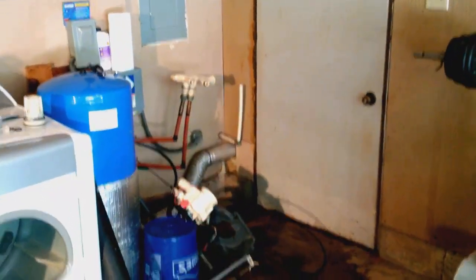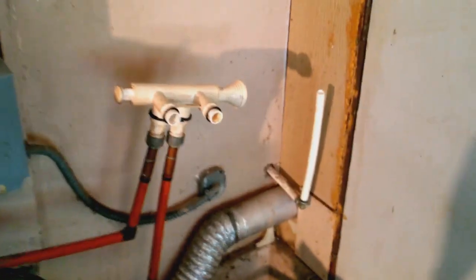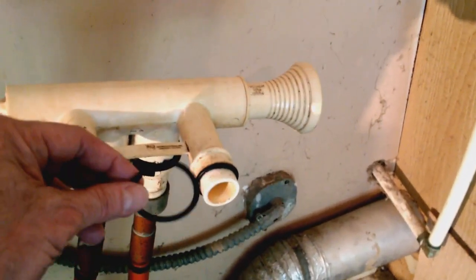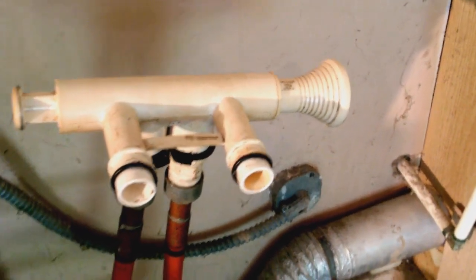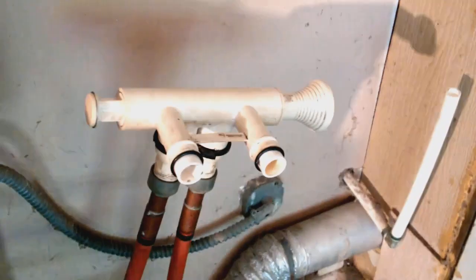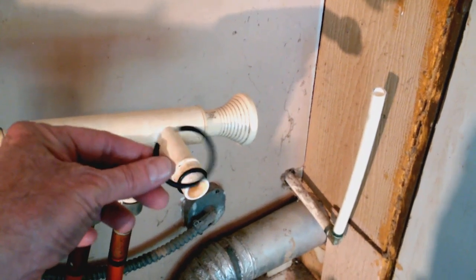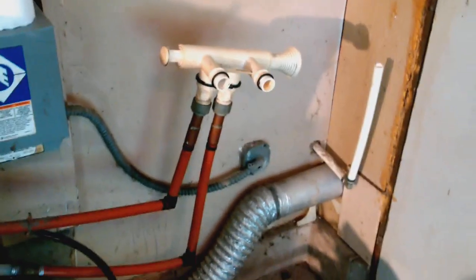We're making progress with removal of the water softener and the resin tank. One of the things I noticed was there was a gasket that was kind of worn out in the bypass valve. I learned that because I was trying to turn on the water from just regular well water, and when I did that, this thing leaked. So that might have been one of the problems with the water softener — the bypass valve wasn't working. I replaced the gasket, and now we're on to taking care of the new resin.